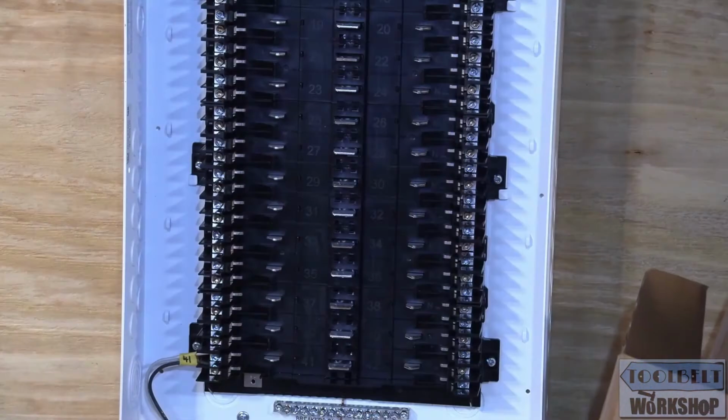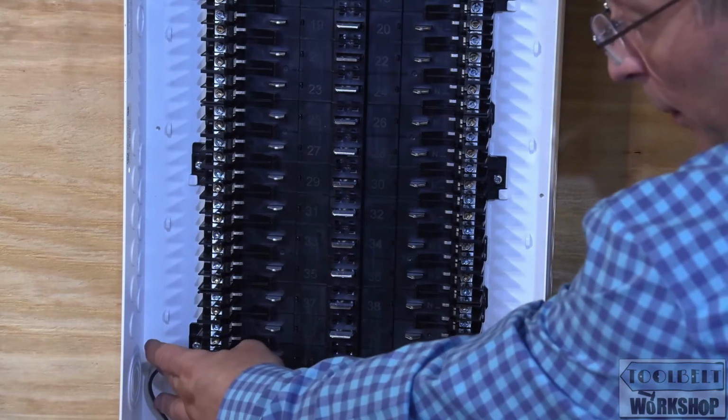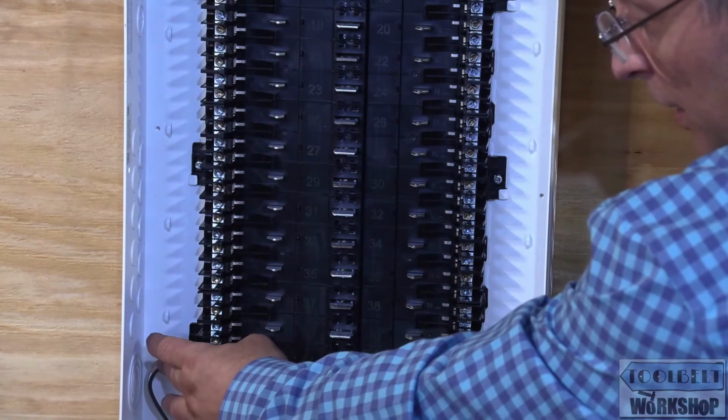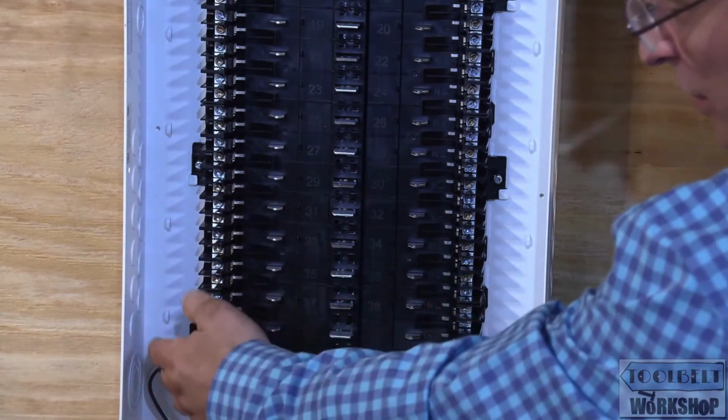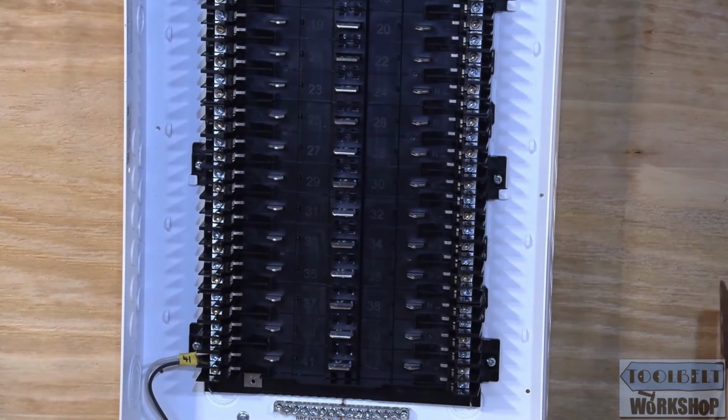Very important. So the next thing I'm going to do here is I'm going to pop in some circuit breakers. And again, remember that in the Leviton, we actually land the conductors right on the terminals here. So if you could just imagine that there's other conductors landed here, and now you send out your journeyman out to the job site to install the breakers. So let's see how long it takes to install 10 single pole breakers plus one 2-pole breaker. And here we go.